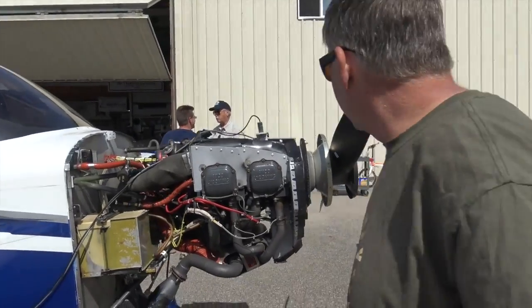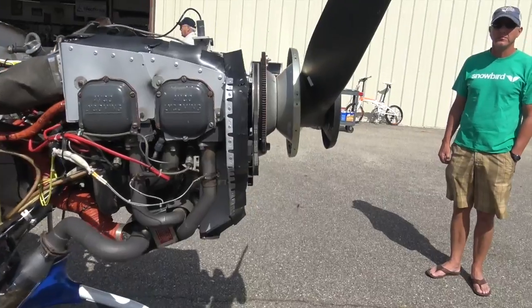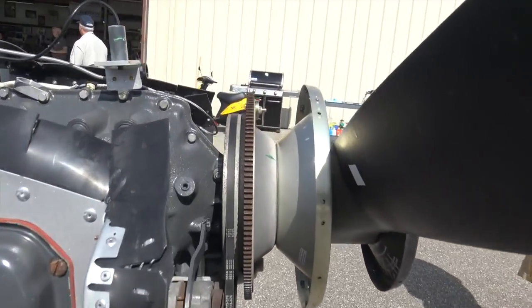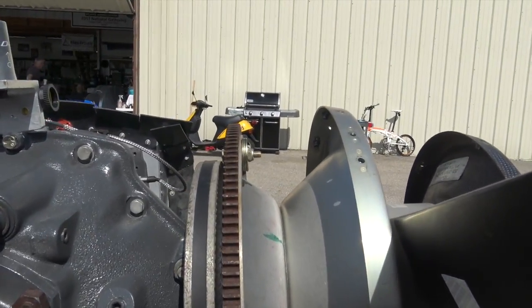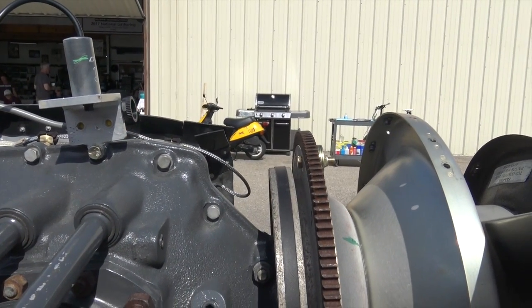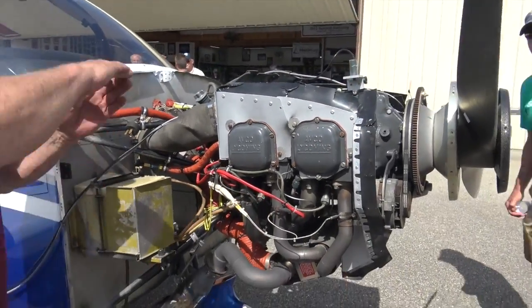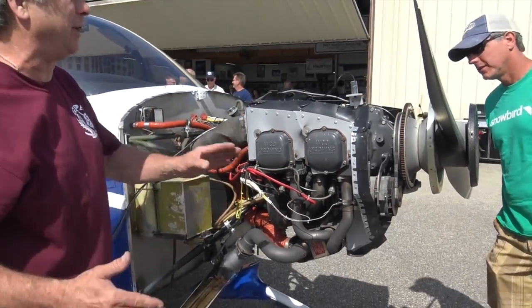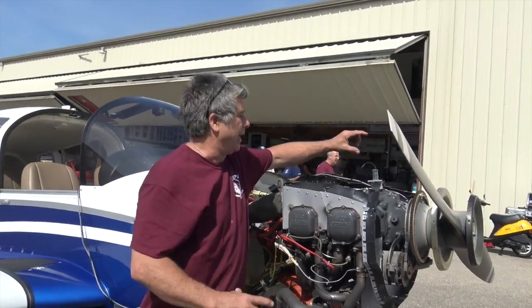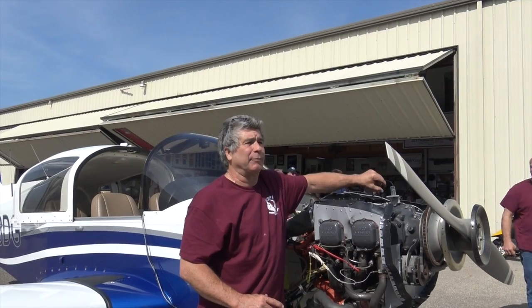And it tells you the climb. Now, you got a picture of the balance, Ken? Yes. Okay. So what that actually meant was our first reading was at 122 degrees, and now we're at 210. We've moved 90 degrees, which means we balanced the big weight, and now we're going to see if we can chase the little weight.